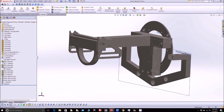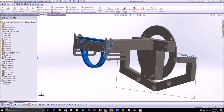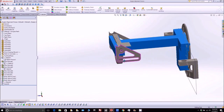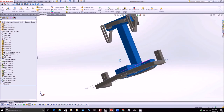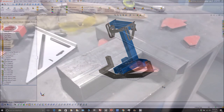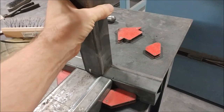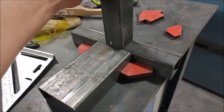Working in CAD again, I've designed this fixture for aligning the engine in the mount. There's the flywheel, two back brackets of the engine mount for reference, a ring that holds the belt drive, and a last bracket that bolts up to the bell housing. The highlighted bits are the actual bracket I'm going to create — it'll bolt up to the flywheel and align the whole engine in the mount. Here are the pieces I've cut from 2x2 and 2x4 steel, and the top piece already has the holes drilled. That'll be welded up tomorrow so I'll be able to line up the engine.